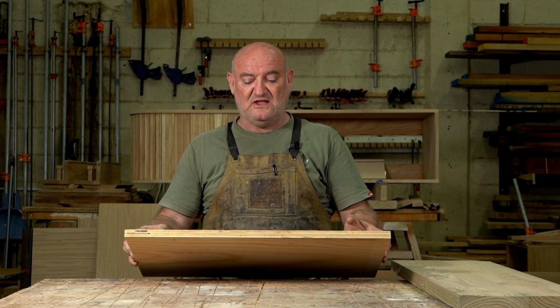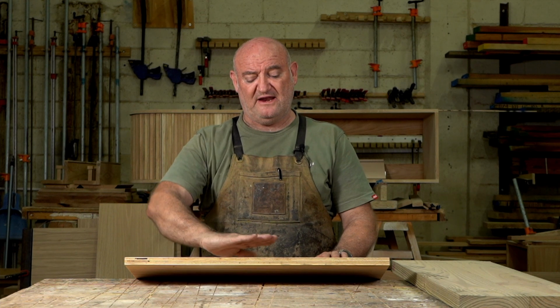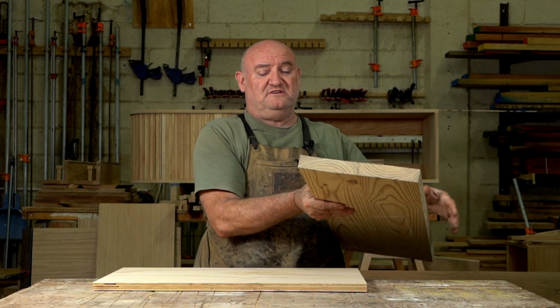If the question is, is pine wood stronger than pine ply, then the answer is no, it's not. Very often it's not. It can be, but most likely it's not. The reason for that is if I have a look at the edge of this plywood board and you really look nice and close, you'll see that the layers over here are very thin layers. So you've got lots of thin little layers over here, which means that this is compacted, it's very, very hard, and its grains alternating, as opposed to a board which is solid pine.